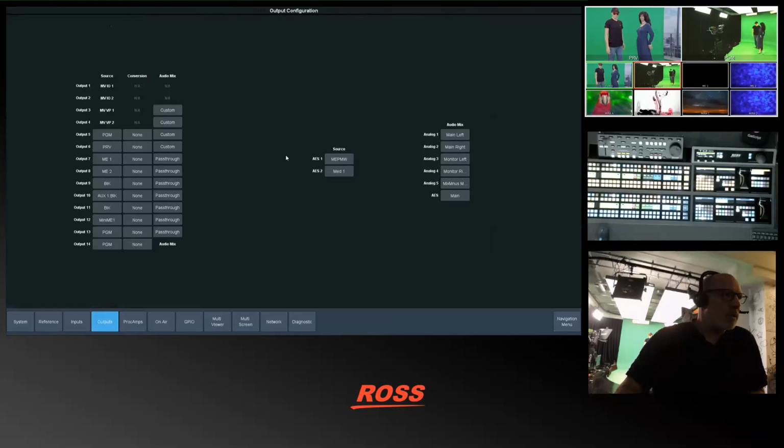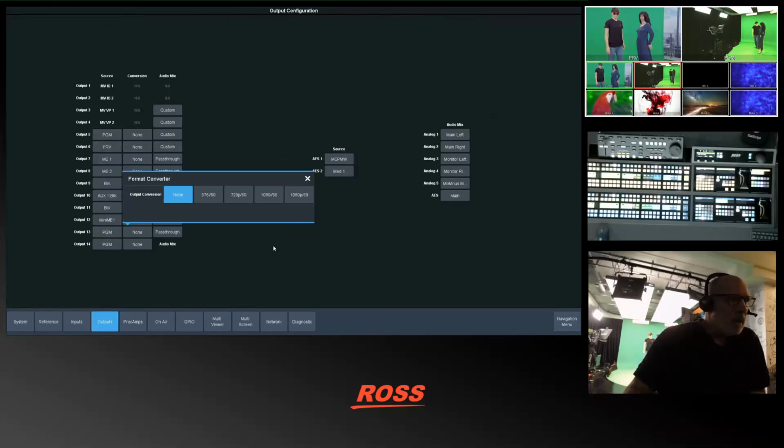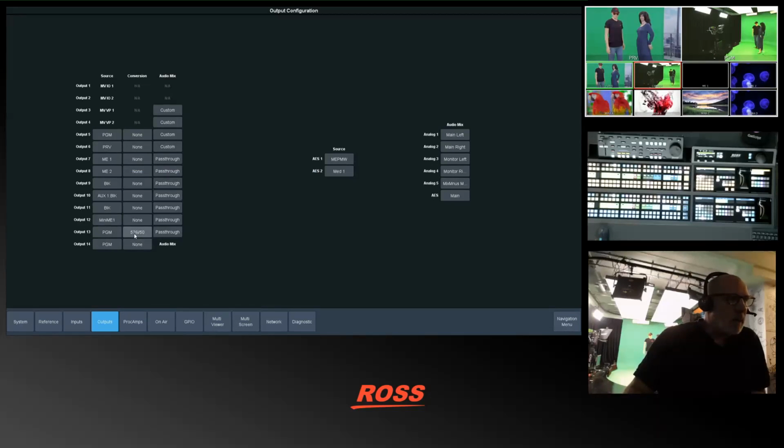In terms of outputs, there are 14 outs, 4 of which are multiviewers, and the rest, 5 to 14, are programmable to do whatever you like. For example, my main program's on output 5. I've got another program on output 13, but let's say I wanted to make that a 720, or God forbid, even make it an SD source. Hopefully we've moved on from that now. All those years of working in 4x3.